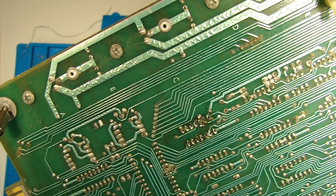So B1 was removed, and after successfully replacing it I finally got a full screen for the first time on this PET — which was very nice to see after all these weeks of work. So the next thing to do is look at the video output and find out what's wrong with that, because it's obviously not quite right. There's a problem either with the EEPROM character set and/or with the video RAM itself, but we'll be saving that for another video.